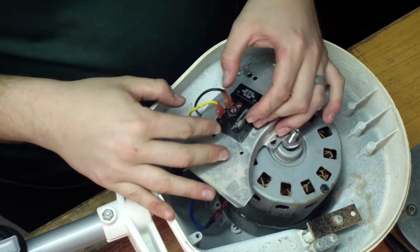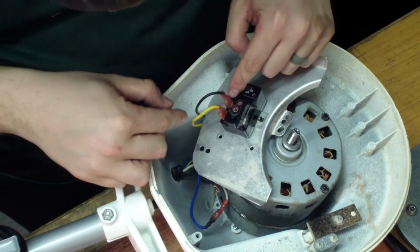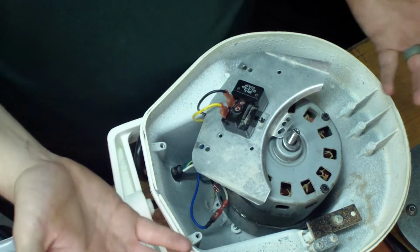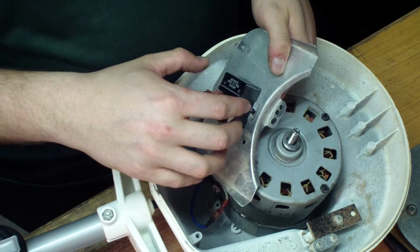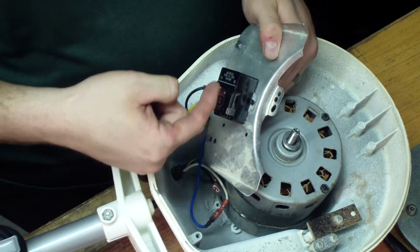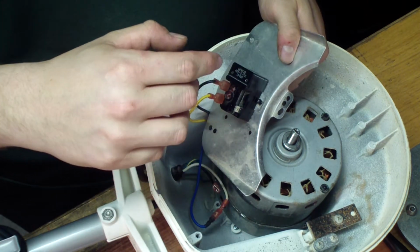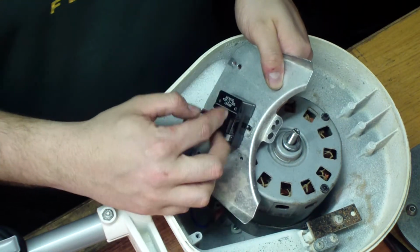But if you wanted to, you can connect a little battery between pin 4 and the run windings, these two, and do a quick continuity test between these two and just tap that battery, kind of like just testing a relay. Or better yet, I've already taken this one apart. I'm not going to show it. You can take this apart and look at the contacts, make sure the contacts are making good. You can physically manipulate the contact pad that moves with the relay being energized, and pretty much, it's all mechanical. There's no real electrical voodoo going on in this thing.